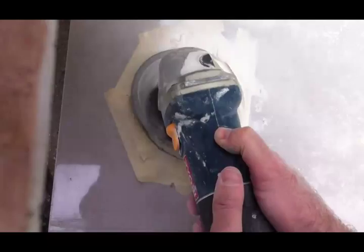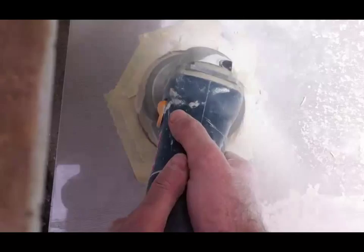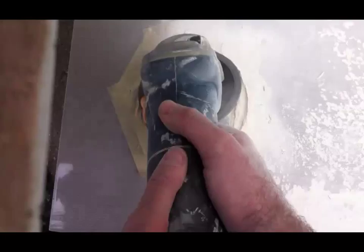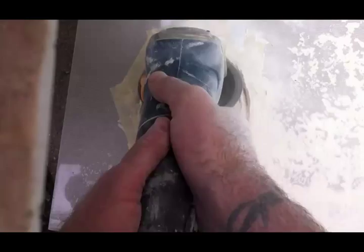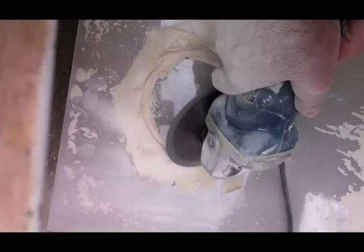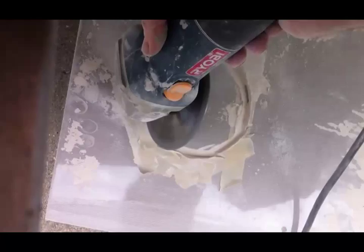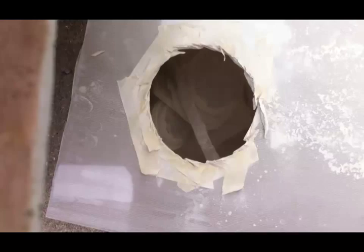I flip it over to the side and use tape because some tiles are hard to mark — tape is your best bet. Use your grinder starting off flat and let the grinder do the work for you. Don't go too fast — take your time, be an artist, try to get a nice round cut. I'm just letting the weight of the grinder do the work. I love cutting holes in tile — just get in your zone and go for it. Two holes perfectly done and installed. You may need to rent a tile saw for this job.